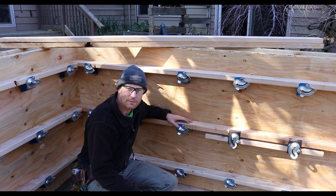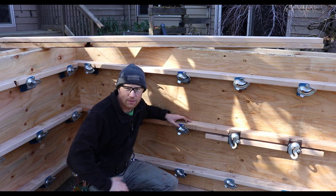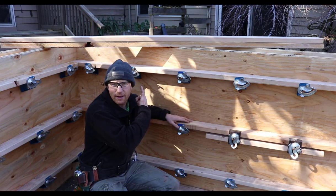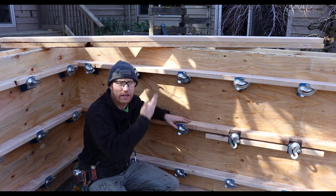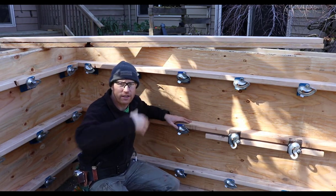So I'd like to get some in the future, but as of now, nobody seems to like to try and purchase them or get them. As far as keeping our wall plumb, again, if I have my strong backs in, I tend to put a turnbuckle or a form aligner or plumber on every 6 or 8 feet.